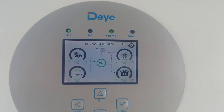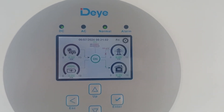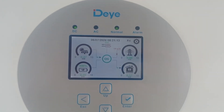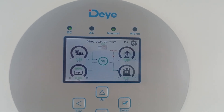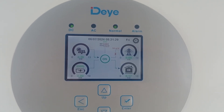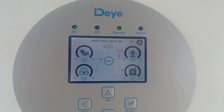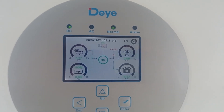That's it for today. You now see how exactly the AC coupling on a Deye or SunSynk inverter works - and it works absolutely amazing. This thing is 10 kilowatt and I've supplied it with a 20 kilowatt Huawei solar grid-tie inverter. It will work the same way with any other solar grid-tie inverter, wind grid-tie inverter, or even a battery inverter - with the only requirement being that it has to be a grid-tie or hybrid unit that can sell, connected to the AC input, not the output. Thanks for watching and subscribe for more.